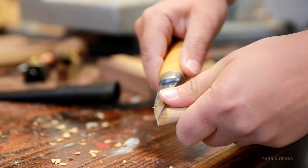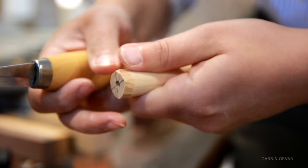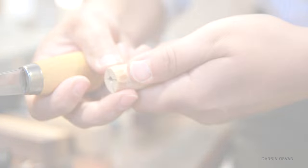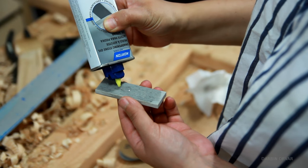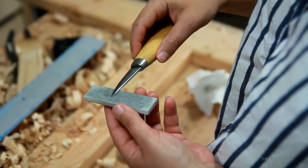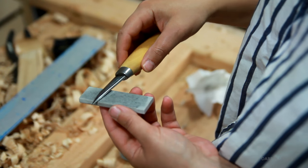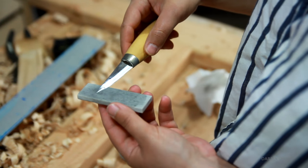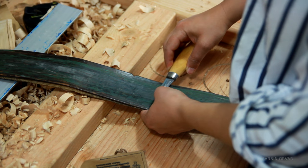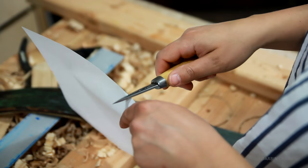After that, I thought it might be kind of fun to integrate some carving, so just testing it out on the Cherry. To get ready to carve all the other handles, I first need to sharpen my carving knife. I'm simply using a small hard Arkansas stone, adding some oil, and then carefully finding the angle and moving the knife back and forth on both sides. Then I finished it on the strop, and the knife felt a lot sharper after that.